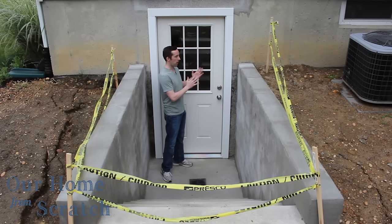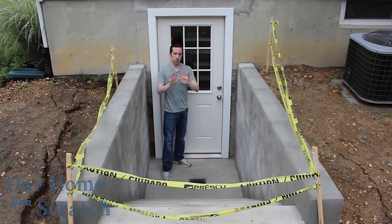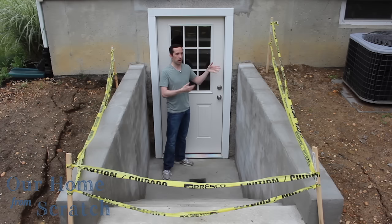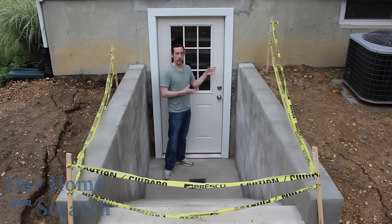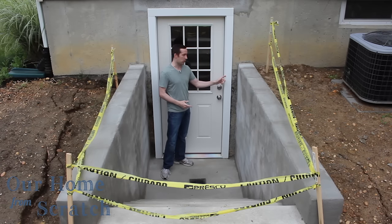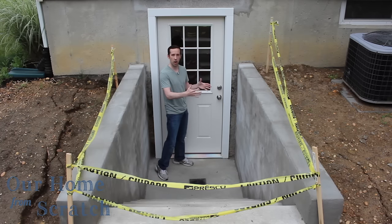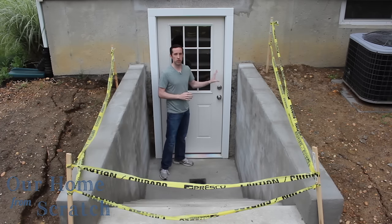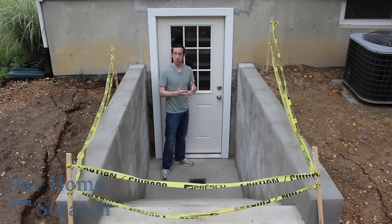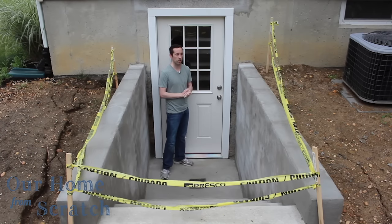When we finish the basement wall and it's all framed out, we'll have to push this door in so the interior side is flush with the rest of the wall. This is a standard entry door for a 2x4 stick-built house, so the jamb width won't work once we finish the basement — we'll need to add a jamb extension. In a future video I'll be showing how to add a PVC jamb extension so that with a thick concrete or block wall you can still use a standard entry door. We could have ordered this door with a longer jamb, but that would have added a lot of cost, and we can do it ourselves for under $100.